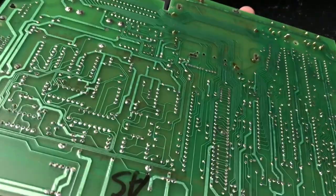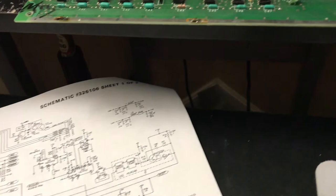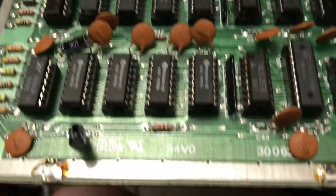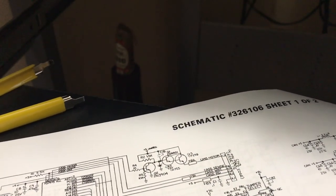What I've done so far is removed the board from the case and desoldered the back shielding to expose the back of the PCB. To my knowledge, all NTSC Commodore 64 boards sold in North America and Canada have these shields soldered to the backs of the boards — I believe this is due to the stringent FCC regulations of the day. These shields have little tabs that fold over and get soldered to the ground plane; you need a pretty stout soldering iron to undo those. What I use is my desoldering iron — I just use the iron portion to heat them up, bend them up, and get the shield off.